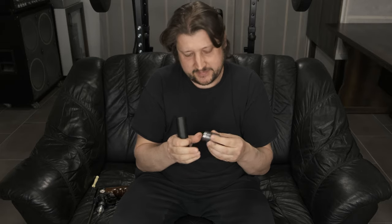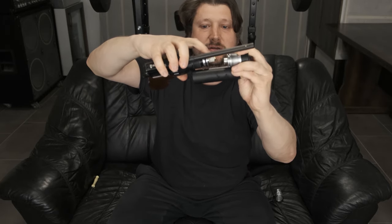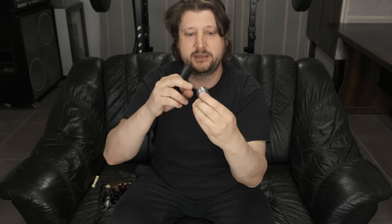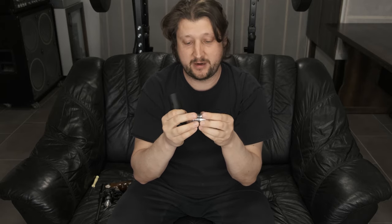So in the first video, I mentioned that if you have a regulator in and you have the original end cap, basically you have it screwed like this, and if you take a look at this, basically there is almost no air, right? Only this part in between is the unregulated air, the high pressure air. So this one is not hollow, it's full because of its design, because this part goes out, and this part is used by the cap. And this one is actually empty, it's actually hollow, and it's hollow right to the end. So this gives me a lot more air.